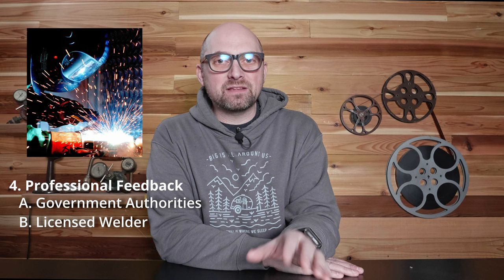The second person I always recommend you talk to is a professional welder. Even if you're not going to hire them to weld the trailer, pay them a little for their time and have them look at your designs and get their feedback. These people do this all the time — they know all the shapes of steel and best practices. You can get their feedback in 20 or 30 minutes, and it's invaluable. Professional welders are also great at helping you source materials as economically as possible — often you can buy from them directly since they buy in massive quantities at prices you can't get elsewhere.